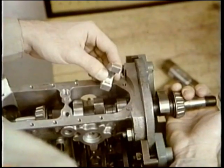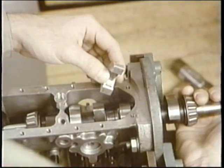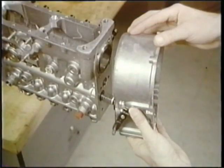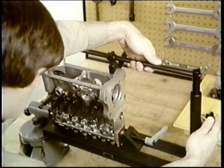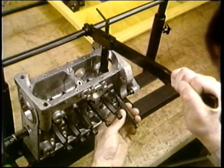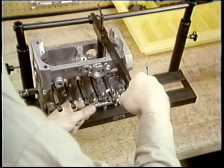Lift out the center bearing and you can complete this part of the disassembly by removing the camshaft. Removal of the pumping elements — tappets, plungers, and barrels — begins with removal of the governor housing. You may want to move the pump to this fixture, which includes the tool for compressing the plunger springs. After you press the first roller tappet, loosen its holder like this. Now you can unscrew the tool for number one. Keep pressing until the tool is out. In the same way, do number two and the other cylinders.